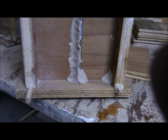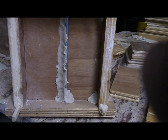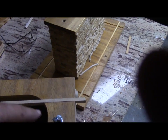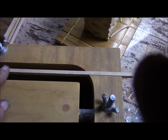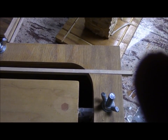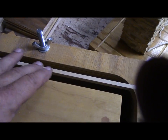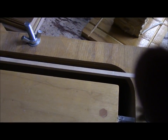When you put it all together, you can see this one is getting ready to pour one half of a urethane mold - this half over here. This spline right here, after it's poured, keeps the top of the mold in place so that it doesn't fall in. If I didn't have this here, the mold would have a tendency to separate from the side and I wouldn't get the correct shape.